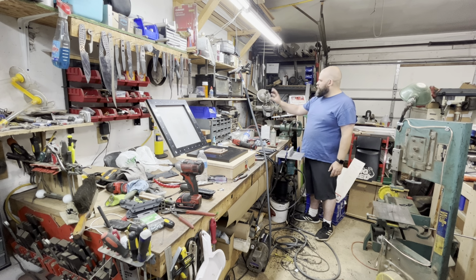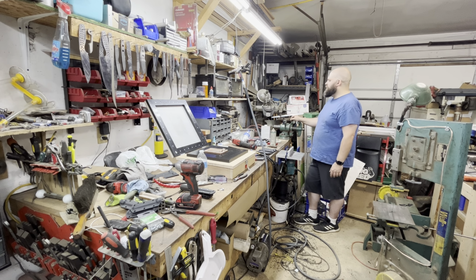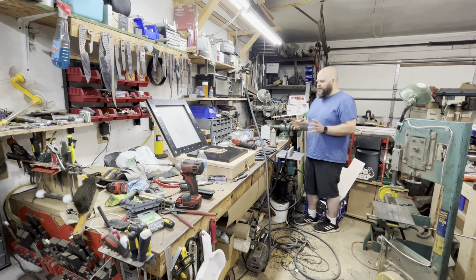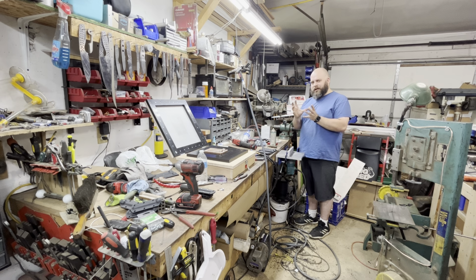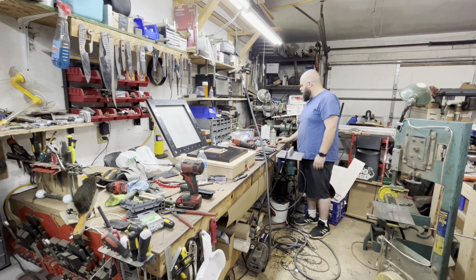So we set that for 2 minutes. Again, I'm at 350 degrees Fahrenheit. This is 80 thousandths thick kydex. 2 minutes seems to be just about as long as you want to put that in there. Otherwise, your kydex does start to kind of shrink up a little bit. So you want to make sure that you're at the proper temps and times when doing this, or that tends to cause some issues as well.